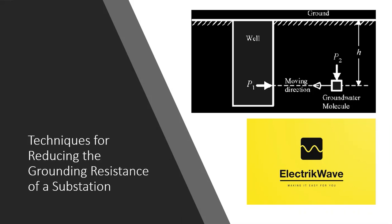If we construct a metal tube electrode as the side wall of the water well, then the metal tube electrode has a low grounding resistance. To maintain the pressure difference in order to lead water into the interior of the metal tube, many small holes must be drilled into the tube. During the process of groundwater moving towards the well, a drag force would be encountered in the soil. So the final water level in the well is determined by the balance between the pressure difference and the drag force. This is a dynamic balance process related to the groundwater content.